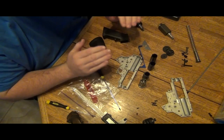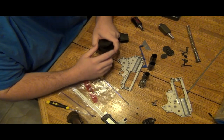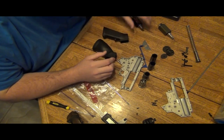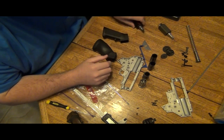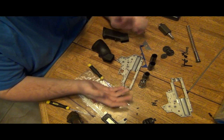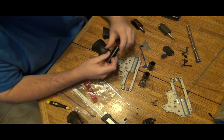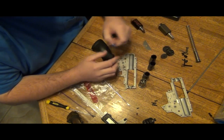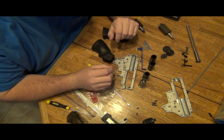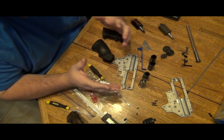If you actually copy exactly, if you make holes in this gearbox and in the body and in the pistol grip, and you look at exactly what you're doing when you're finished, you'll see some things change. You'll see the motor doesn't go up as high as you're supposed to have it. You'll see that there's a gap between the pistol grip and the body, as an example. You will see something with the piston wasn't checked, or the tappet plate. So these actually come into play, and what you have to do is copy the best way while it's the finished product, or you're done with your shimming.